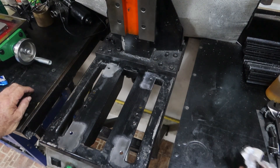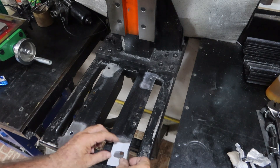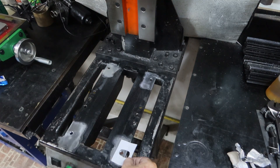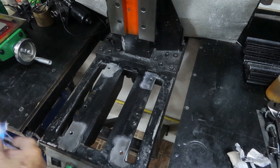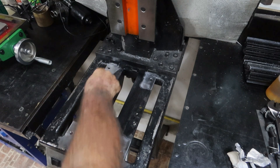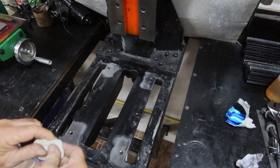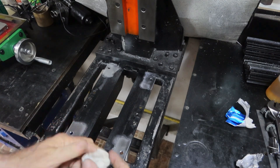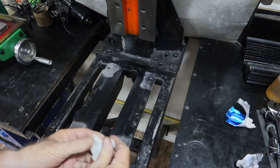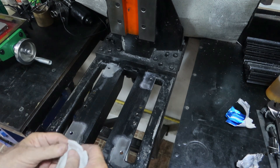I had a quick look at the bottom of the mill and made a little template for this little pad on the bottom where it gets bolted. I'll clean all the paint off there, mix some of this epoxy up. I'll put it inside here in those areas — let's hope this stuff doesn't go off too quick. I'm going to put a bit of masking tape over the epoxy because I don't want it sticking to the bottom of the table and gluing the damn thing down so it never comes off again. I can't put it on too thick either, but I need it thick enough so that when I bolt it down it'll squeeze out.